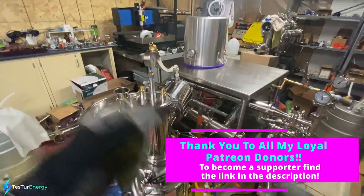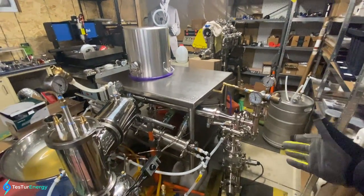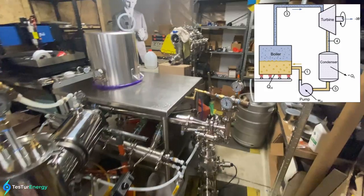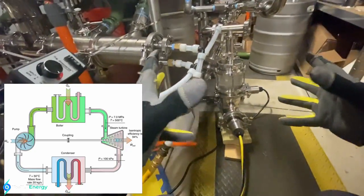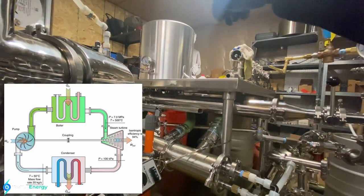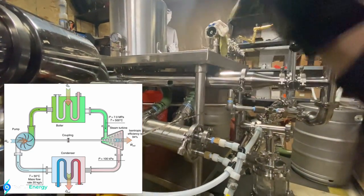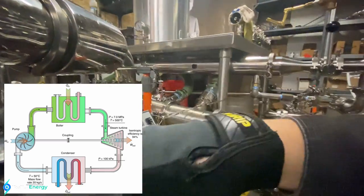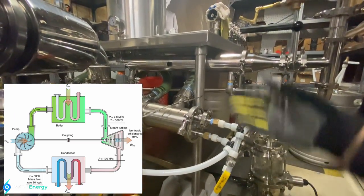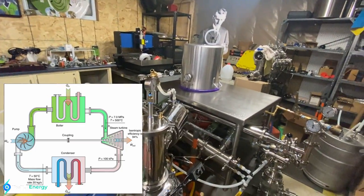How the system works is a basic steam Rankine cycle. You put in energy, it makes steam — energy first goes to latent heat of vaporization, then to pressurizing the steam. You exhaust that steam into a superheater, which goes directly to the turbine. Through the turbine the steam expands, goes into the vacuum chamber, and through these pipes into the condenser. The condenser has cooling water circulating through it to remove the latent heat of condensation, which is then dumped into the air by the Tesla fountain and used for heating my workshop.